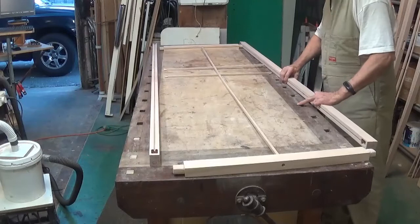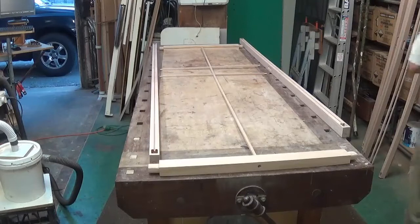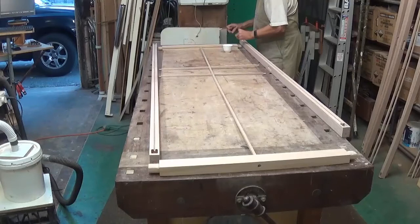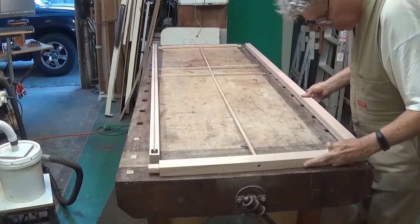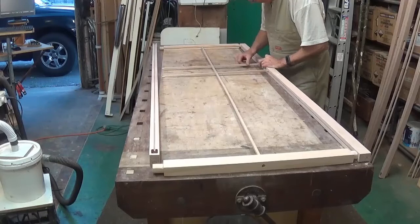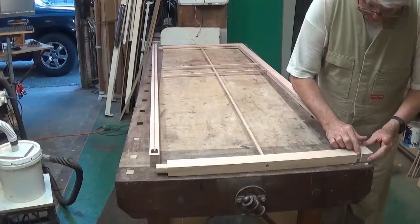As you will see here, I started to assemble and then realized I hadn't applied glue to the tenon on one of the rails, so I had to pull it apart again and apply the glue. I only apply glue on the large sides — the vertical sides of the mortise — because the rest is end-grain, and gluing anything to end-grain is useless. Applying glue to just two sides of a mortise and tenon gives plenty of strength; it'll be stronger than the timber, and if you try to pull it out you'll damage the piece once the glue is set.